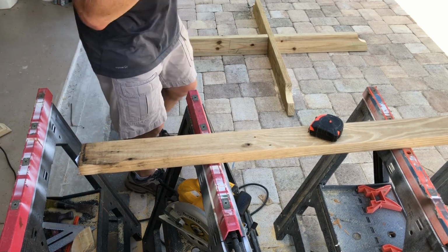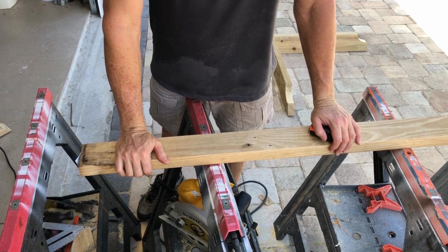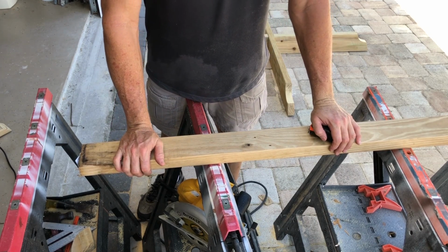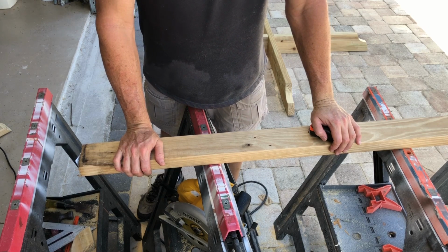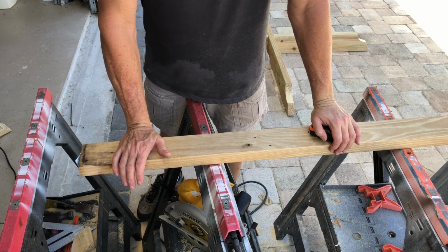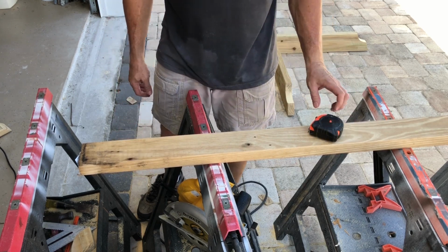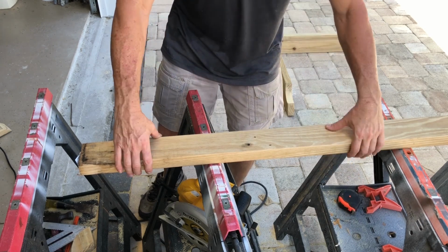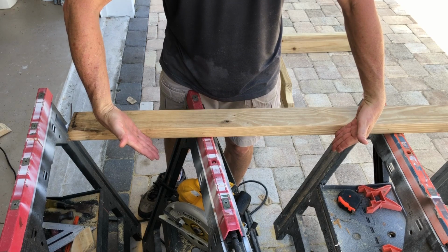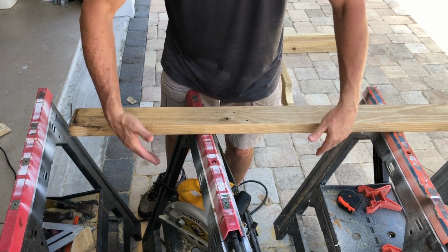Okay, I'm ready to make these cross braces. I think at the beginning I said these were going to be 48 inches. They're actually 32 inches. So you could buy a 12-foot 2x4 for this. I happen to buy 2 8s. I don't know how the price difference works out, but it's pretty close. But what we're going to do is make cuts like that, right, so it slips into the frame. So we want these angles to be opposite.